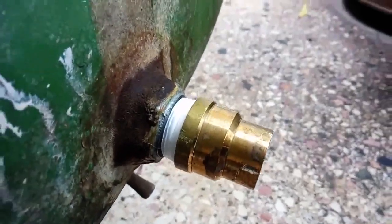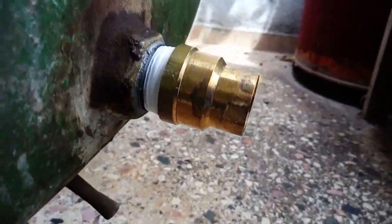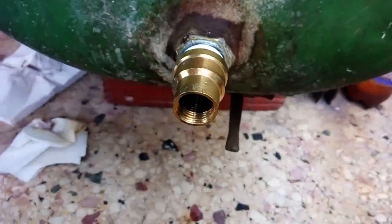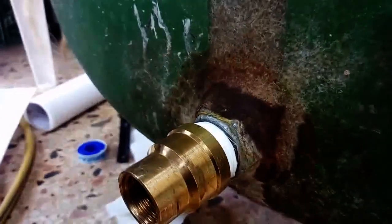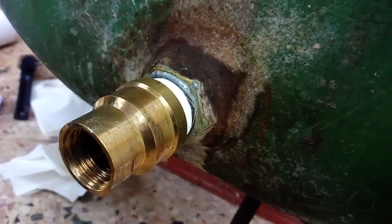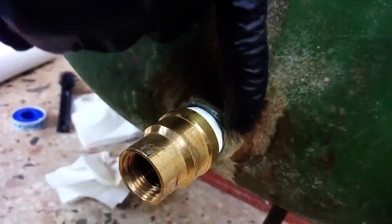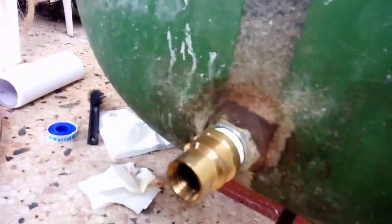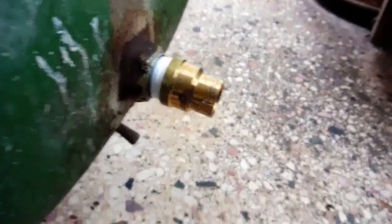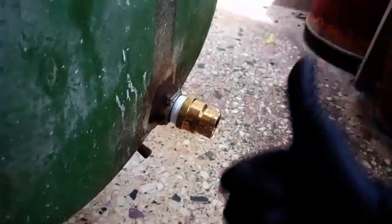If you know you won't be removing that brass part in the future, you can also use liquid thread locking. I'm not sure how well thread sealing cord works on diesel fuel, so I don't really recommend it — I haven't had experience with it. That's why I recommend hemp fibers and PTFE tape. That's it for today — quick and easy, thanks for watching, you're awesome.